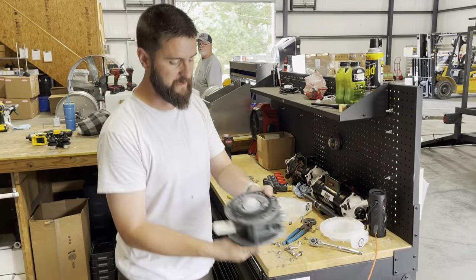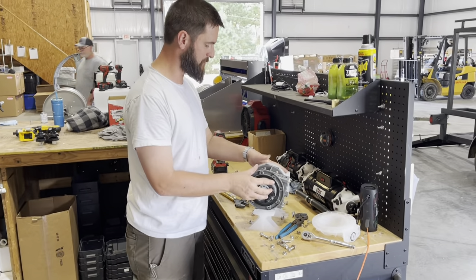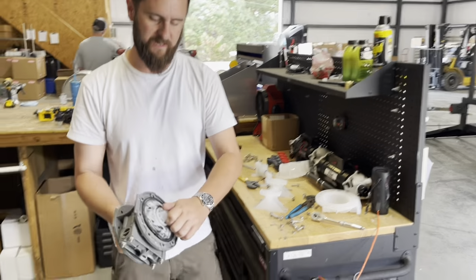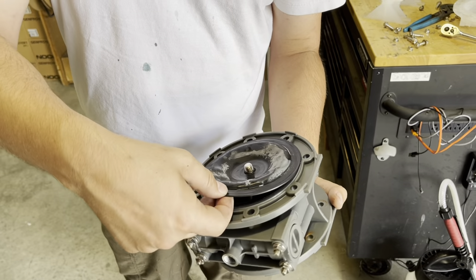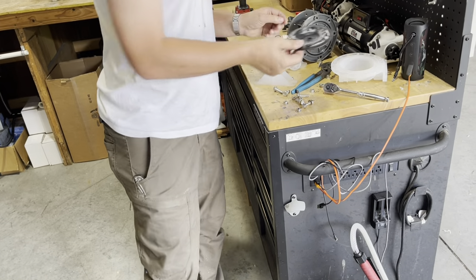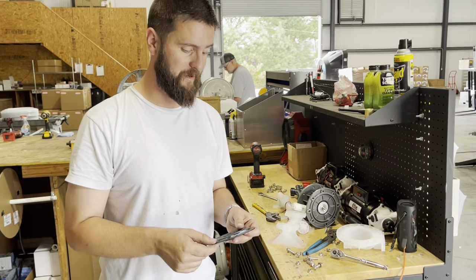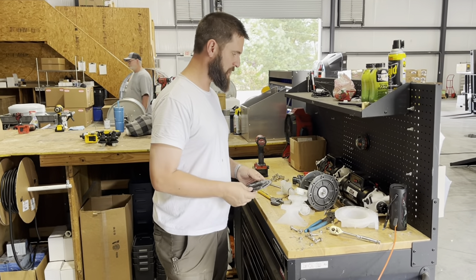Once it does that, it deforms the rubber piece. You can buy just this piece and replace it. Fortunately, this side on this one is still good. We're going to take it apart — very simple to do, it kind of goes together like Legos, maybe a dozen bolts. We'll slap it together — pretty easy to take apart. We'll take these two plastic pieces loose, and that'll allow us to remove this. You want to be careful because this thing has pumped thousands of gallons of bleach, but this side is still fine. We'll take this out, take that pump apart, install this one, and see if we can get the pump running so we can sell bleach. We had a local guy come to get bleach and couldn't pump any because it was spraying everywhere.